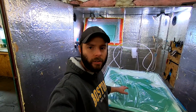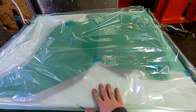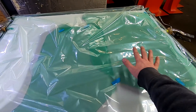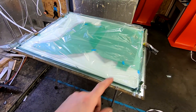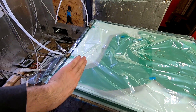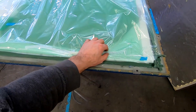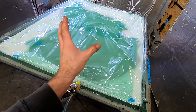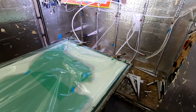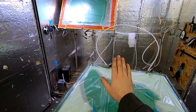Alright, so we got all of our materials - let me show you what's going on here. You obviously saw us do the time-lapse of laying up the carbon, then goes the peel ply, then our flow net. You can see where we overlapped it - the flow net is what allows the epoxy to quickly run through the part. Our inlet is going to happen here on the bottom, it's going to flow through the flow net nice and quick, and as soon as it hits the peel ply it's going to slow down, giving it time to really saturate all the edges and the entire part. On our inlet line you can see we use spiral wrap because this one's going to use a lot of epoxy - you need that inlet volume to let it infuse through the part in enough time before it gels up on you. Then we have two vacuum lines on the end going up to one. It's going to be sharing the oven with an E46 sunroof that we have on order, so that's going to be stuck up there - this is just going to be lifted into the oven as soon as we vacuum it down.